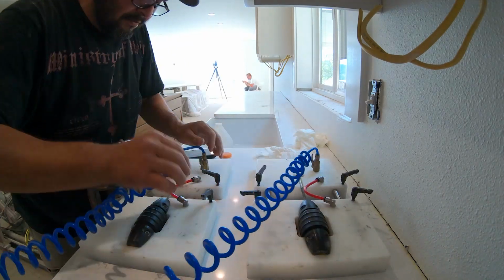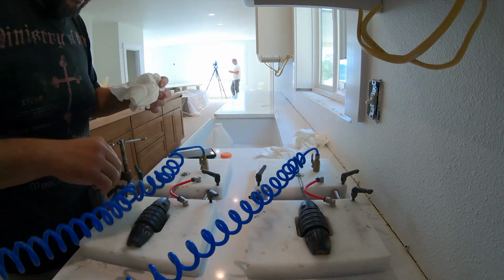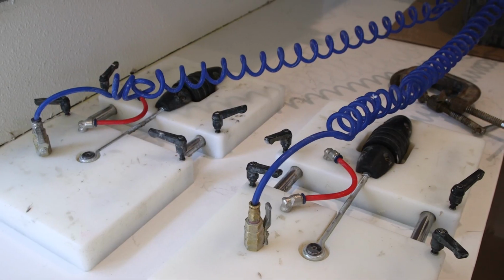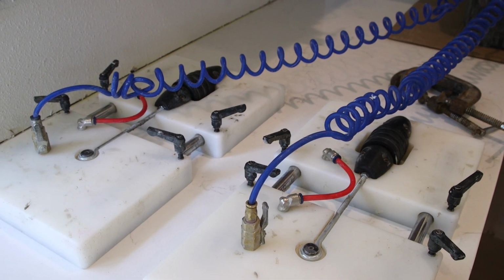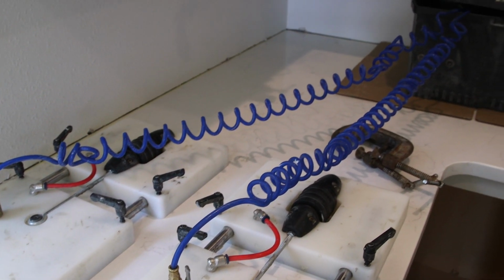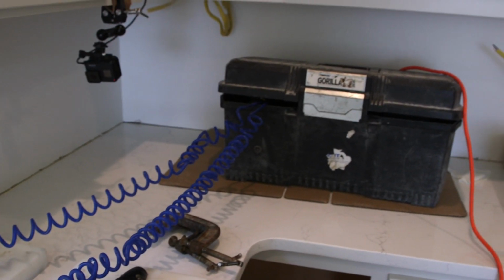These joints need to be perfect. I mean, perfect as in the thickness of a sheet of paper. And then this epoxy joint compound and the pneumatic clamps pull up and make invisible any space that might accidentally be left in that joint.